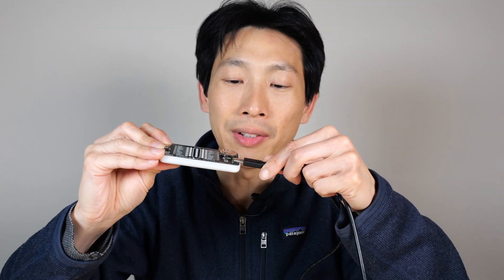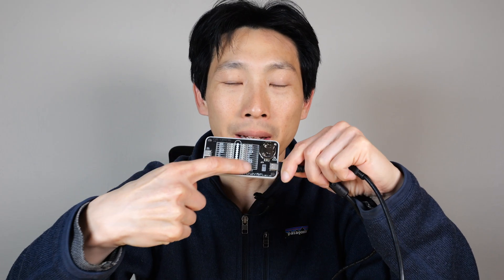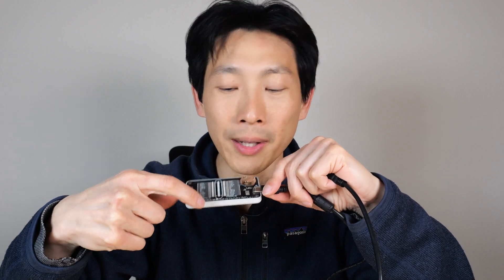If you do a little bit of electronics tinkering, you might have tried to stick a probe down a USB-A connector. But when you get to USB-C, this is nearly impossible to do. That's why you need some kind of breakout board like the KBRIQ-U. This will allow you to safely plug it into something, and there'll be a lot of spots to do the probing. Even if you have a microscope and a very sharp probe, you'll probably mess up the USB-C connector.